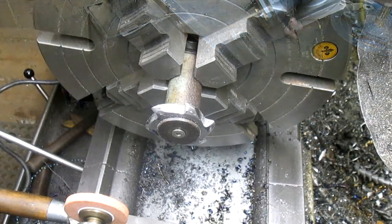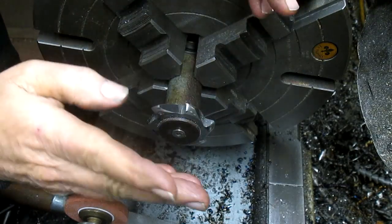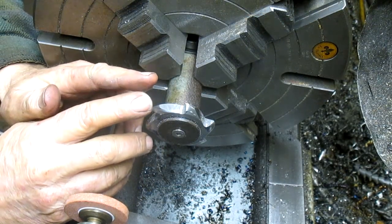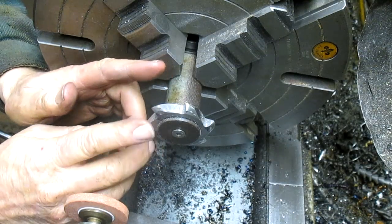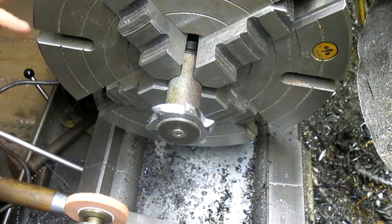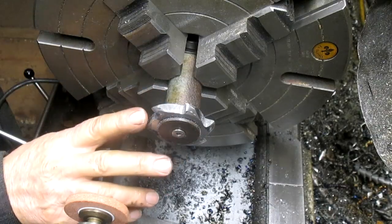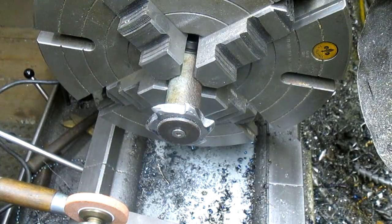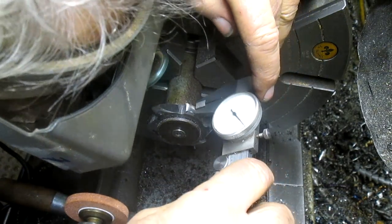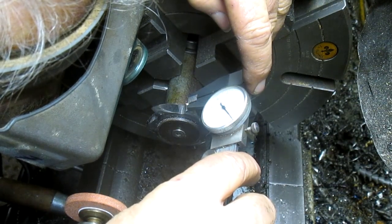Okay. Forget that. Okay, well, it turns out that our web was just a little bit too wide. It made the arch too wide, so we needed to bring it in so it was narrower. It's such a slight amount that I came in and squared off the top here, and then we're just taking measurements from the top. And supposedly it's 40 thousandths. And we're sitting at very close to that.